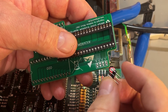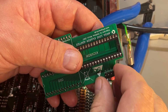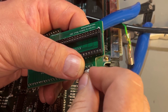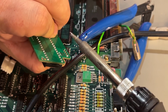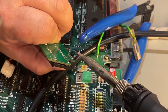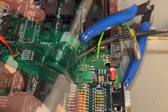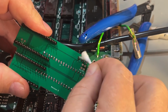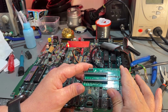For the wire connection I'm using this square pin header because then I can use those standard DuPont contacts, or what it's called. I'm just soldering one point first, and I hold my fingers to straighten it. Not on the one I'm soldering. I have done that mistake before, and that hurt. ABC, always be cleaning.